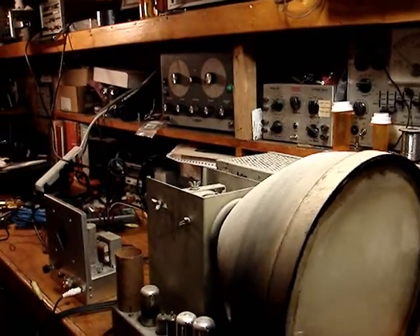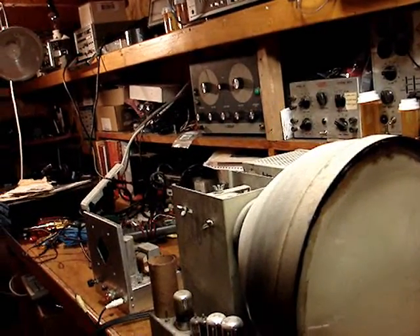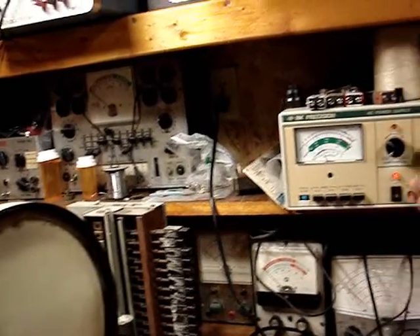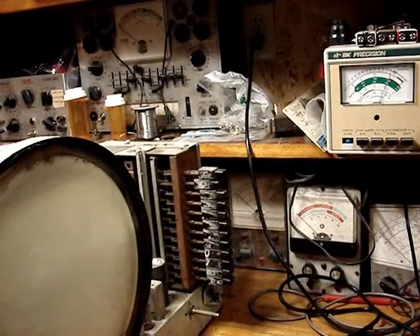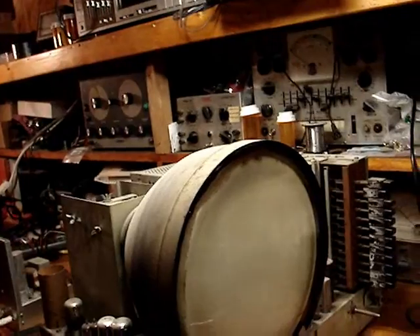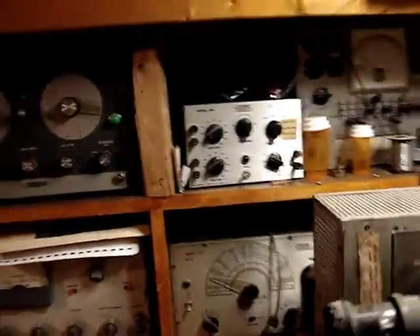The amps are staying low — low current draw. That's an indication that maybe... we're going up. I see tubes lighting up. We're not quite at 120 volts — there we are at 120. We're drawing about an amp and a half. Tubes are lit. I think I'm hearing — yeah — audio is working on this set. That is absolutely amazing.